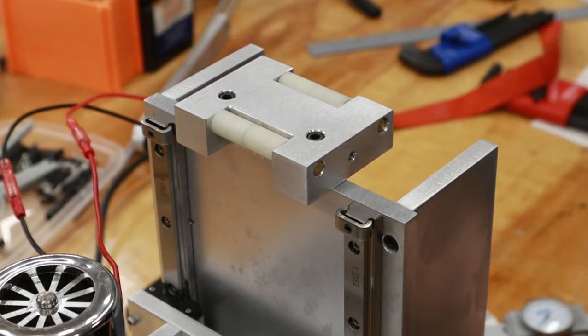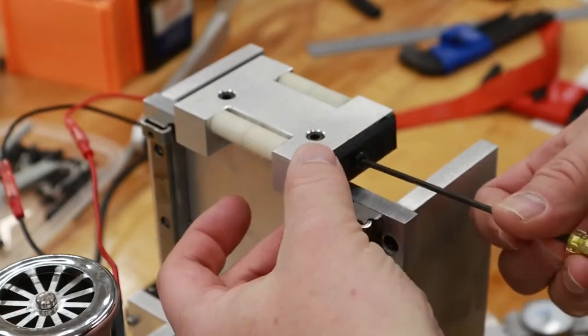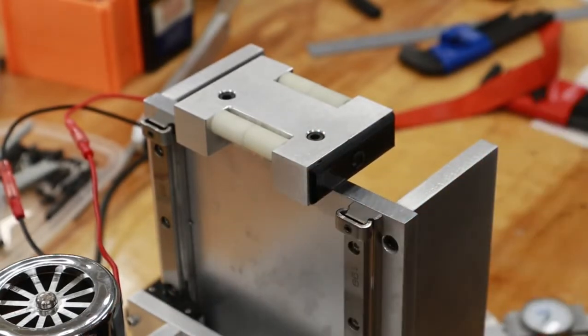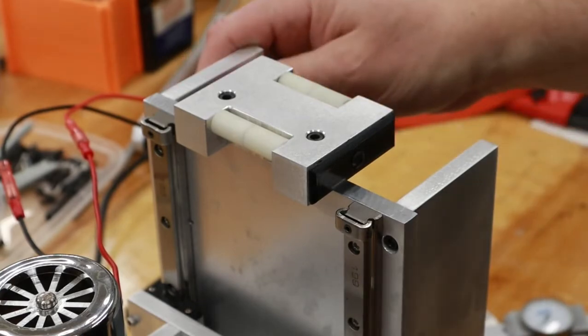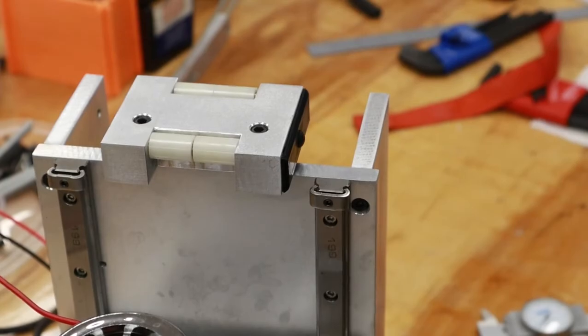It's made up basically, I think, of 3/4 inch thick aluminum, and I just milled out a couple of slots on the milling machine for clearance of the rollers. The rollers are hardware store items. They're nylon bushings, and they spin on axles that are made out of a brass rod, which luckily I had laying around here in the shop. And for an idea of scale, the brass rod that serves as the axles is 1/4 inch in diameter.